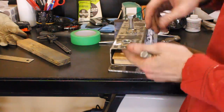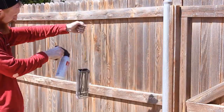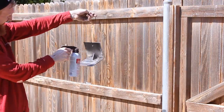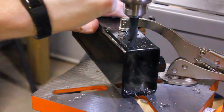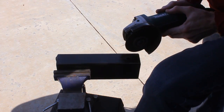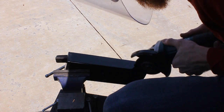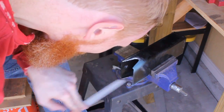We then go and clean up our welds and cut some pieces of wood that will be utilized as our jaws. At this point it's pretty much done — I went ahead and got it all nice and painted black. Unfortunately, after I got it painted, I realized that I missed a step. I like putting a groove or a window on each side of my vise so that I can easily grab the jaws and move them in and out. So I ruined the paint, went in with an angle grinder and cut this window, and then went ahead and repainted it after I ground off the burrs.